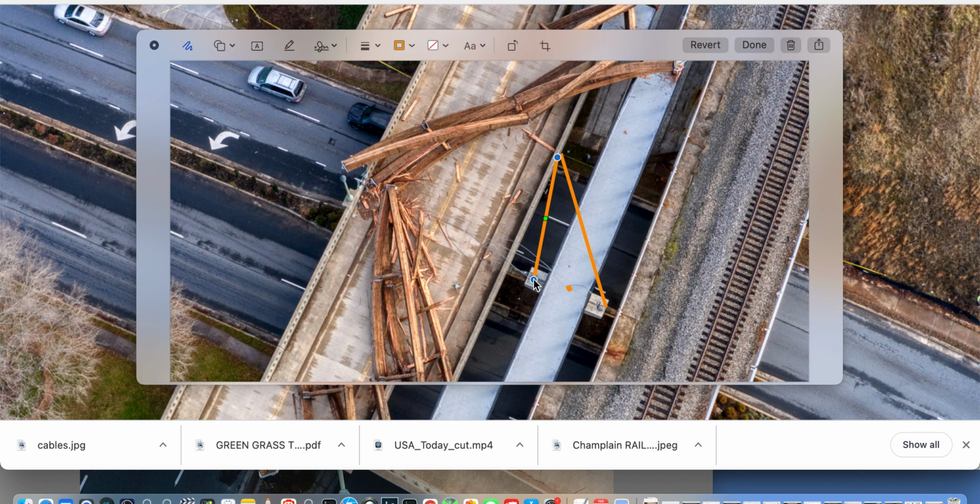Let's just use these points here. You just have to extrapolate this in the air, okay? So let's make them meet there. And now they keep each other. They keep this from twisting left. You try to go left, this one becomes in tension. If you try to fall to the right, this one takes up the tension. But what happens if you put them too close? It doesn't work, does it? These are too close to each other. It can't do it. It just wants to fall over the whole thing.